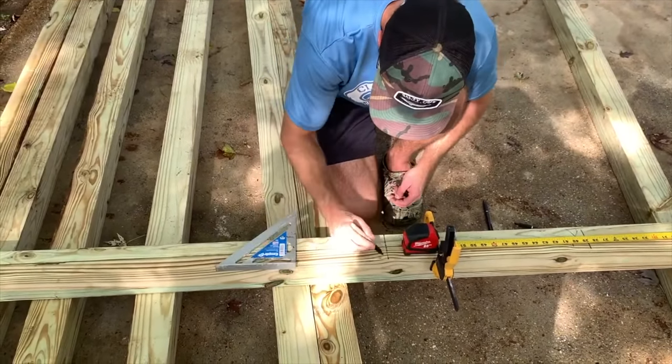Now the outgoing piece of conduit from that GFCI box is going to be routed below grade. And this is where we need to start planning and actually excavating to the required depth. So you have many different conduit and cable options when running electrical cable below grade, and the type of conduit slash cable you're going to be using will determine the buried depth you'll need. As always, consult with a licensed electrician and consult with all applicable electrical building codes to get the requirements for your specific area.